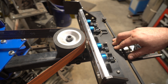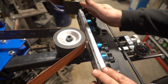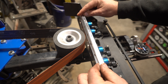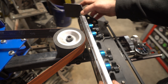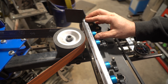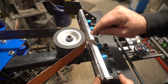One of the cool features of this attachment is the tapering feature. If we take this bolt out we can actually move this end of the attachment closer to the belt, which will taper it. So when we start tapering, we'll put the blade on here and then gently start our taper. You're always going to be hitting the back here first because it goes forward, so you're going to be starting there and moving forward — taking a little bit off the back and then keep going until you get it where you want.